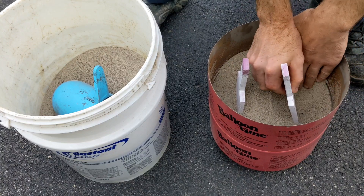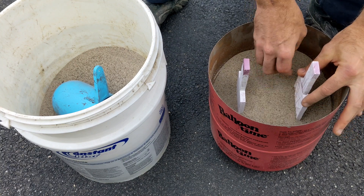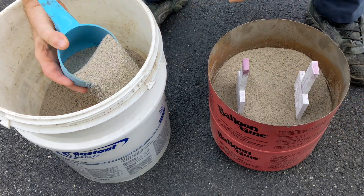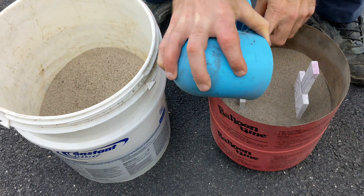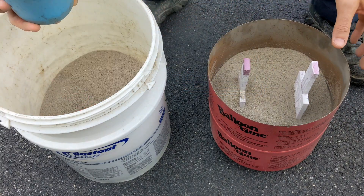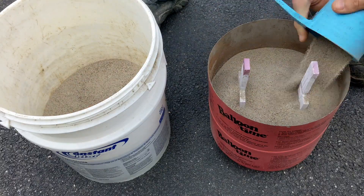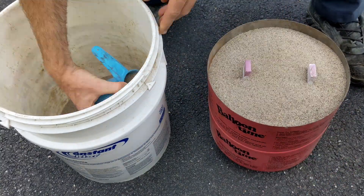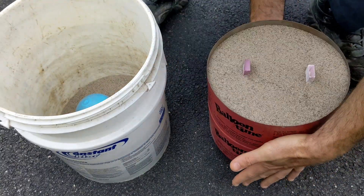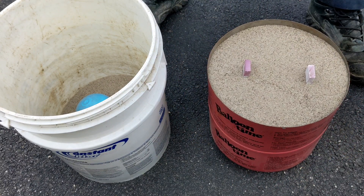In preparation to be cast, I needed to coat a thin coating of wall plaster mixed with water on top of the foam. I will leave a link in the top right hand corner of the screen as well as a link in the description on how I coat the lost foam patterns before casting them. Now that the pattern is prepared, I am burying it in fine dry sand to be ready to be cast.